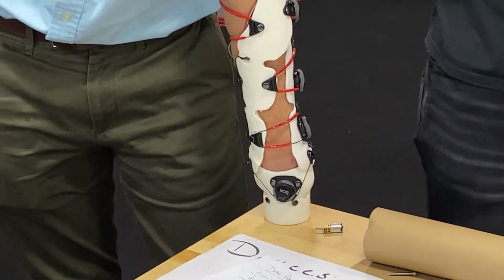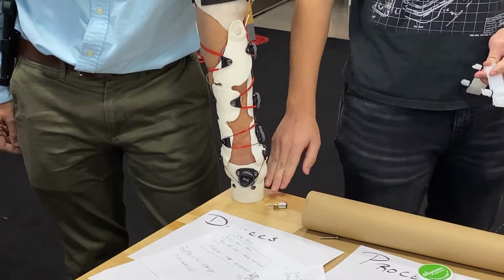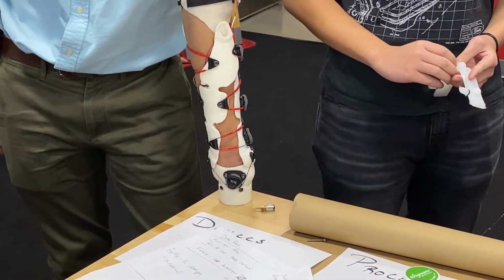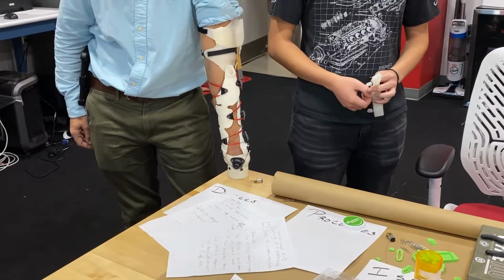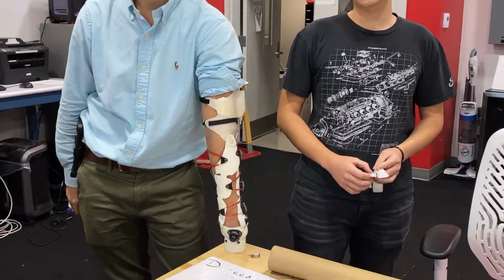Can you say the nozzle temperature again? You said the bed is 110 and the nozzle? 110. Nozzle for nylon is 250. Oh. And I use really small layer heights and got better results with warping. Okay, 0.05. Have you guys tried using Magigoo PA?